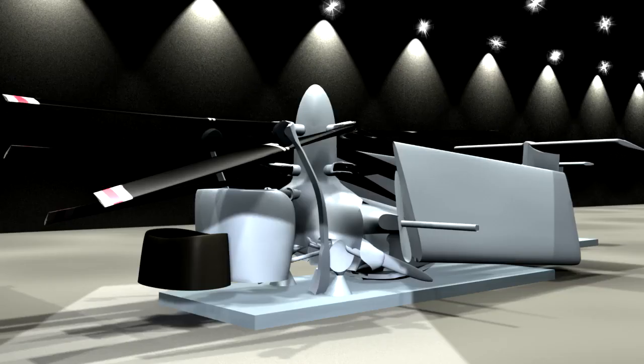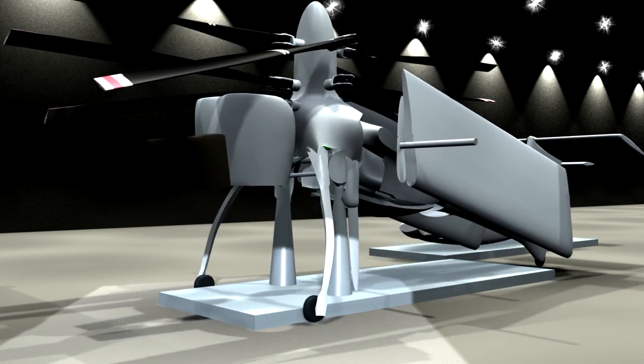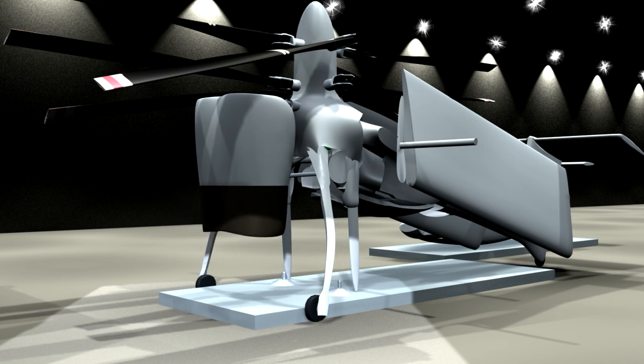The cargo unmanned aircraft is transported on a special pallet with jacks for anchoring the aircraft during transport and lifting the aircraft, as shown here, so that its front landing gear can be attached. Finally, the infrared suppressor is bolted onto the T-800 tailpipe.